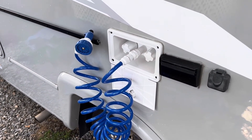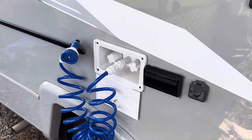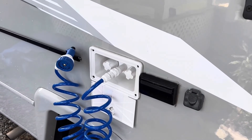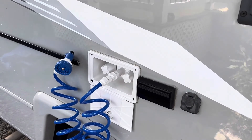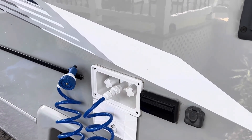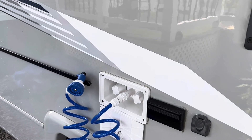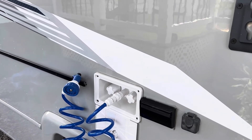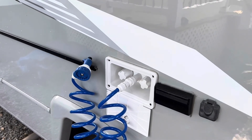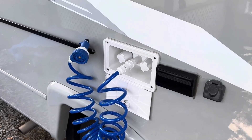If you're going to do a project like this — installing something in the sidewall of your RV — you do want to check for studs. One way to do that: since my project was in a cabinet, I cut away the plywood on the inside wall panel, peeled it out, and checked for studs. I peeled the foam out and didn't find any, so I knew I was good to go. You don't want to cut through studs — not a good idea. Anytime you're cutting into the side of your RV, check for studs, wires, plumbing, and anything else in the sidewall.